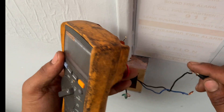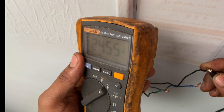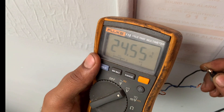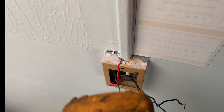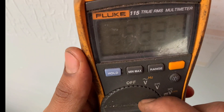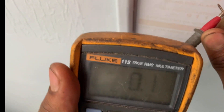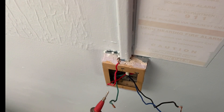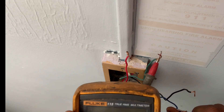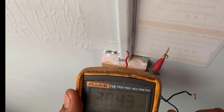For demonstration purposes, I'm metering it so you can see — you have 24 volts, 24.55 volts there, so we have our power. I also meter it for the end-of-line. Put it on your resistor with your multimeter and confirm that you're getting the end-of-line reading. Putting the meter on to the end-of-line wires, I get 3.84K — a 3.84K resistor — so it's all good.